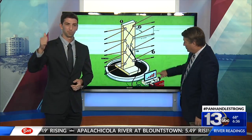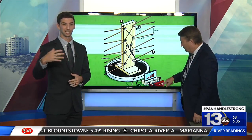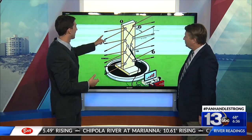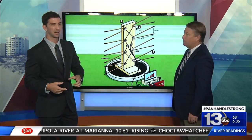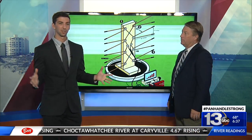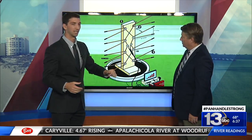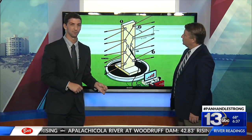You just hook it up to a coax cable and run it right to your TV. Note the diagram is not to scale — the board is not that big. Just press search and it'll scan through the channels. The V-shaped wires pick up the UHF channels over the air, and the long wires in the middle pick up the VHF channels, matching the frequencies to the wavelengths traveling through the air.